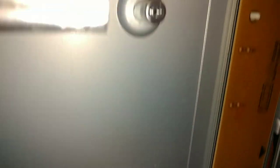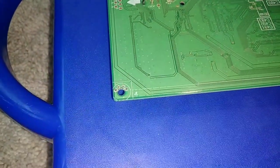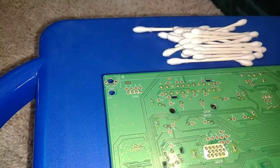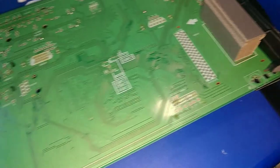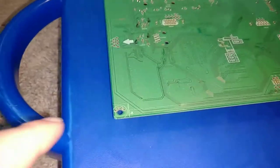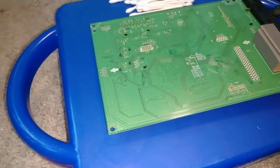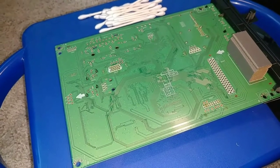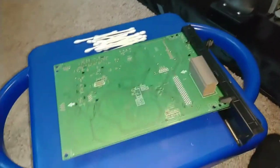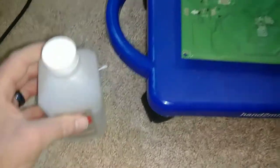From where it should be making a connection, this one is really bad. There's some corrosion there and some corrosion there, right where it should be making a solid ground. Here's the board itself — you can even see the corrosion on the spots where it should be grounded. That actually looks like it could be some resin from the board, or some resin from the solder that they didn't clean up. There's definitely something preventing this from having a solid ground onto the chassis. So let's clean that up — I've got some Q-tips and some isopropyl alcohol.